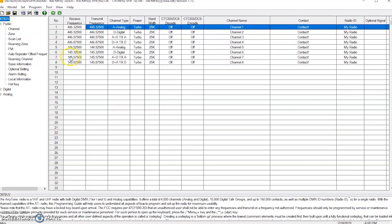You can dump a whole code plug in here and put all these different frequencies in and go through different zones. What I've found with DMR is there are several different ways to program it. For instance, what I would do is: Zone 1 would be local repeaters, Zone 2 would be repeaters I'd hit while traveling, and Zone 3 might be my hotspot. Some people do it where Zone 1 is all channels with a certain talk group — there are different ways of doing it.